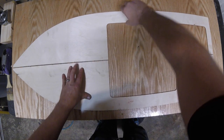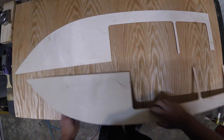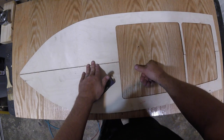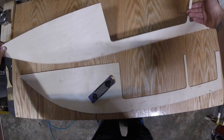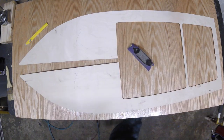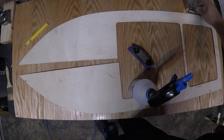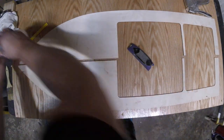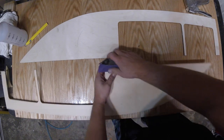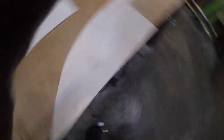So this is going to be our top sides. We're going to flip this over — it's going to be our top side. You want to mark that. I'm going to mark this with a T. Then we're going to take some alcohol. So what I'm going to do is flip this over to the bottom side — this is the side we're gluing — and I'm going to put just a little bit of a bevel on this. The easiest way to do this is I put it on the bench edge, just like that, just a couple degrees, and do these little bits.